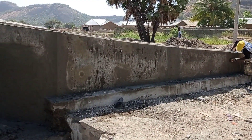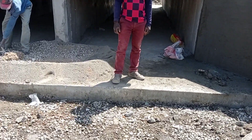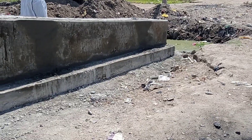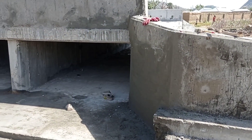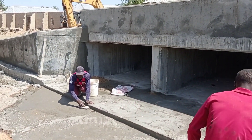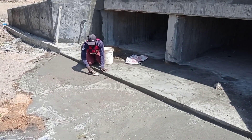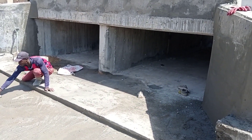You can see that we are doing small patching or filling of the concrete. The reason we have to do this patching is because when we remove the formwork or shuttering, some places have to be dressed up — this is why we use a small mortar mix on such places. Concrete was also poured after the apron, and we did dressing of the concrete so that water can pass or flow through the apron easily.